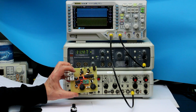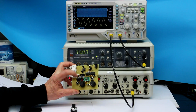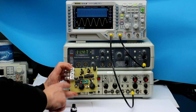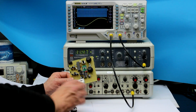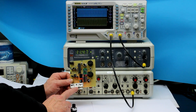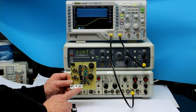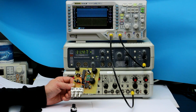Because there are some frequency generators where the sweep input needs a bipolar input, for example from -5 to +5 volt, and by setting or drawing the little jumper you can change between unipolar and bipolar output. And 2 little scale potentiometers. Well, and you can see we have 3 BNC outputs. One is the DAC output for the sweep frequency, then an X output if you want to use your oscilloscope in XY mode, or a sync pulse which is output when the sweep starts. And that's basically all. You need a 12-volt power supply, external, and that's all.